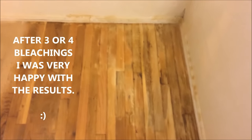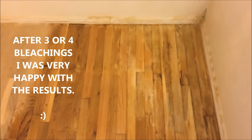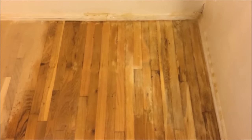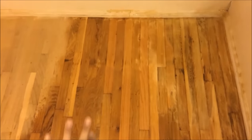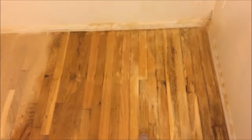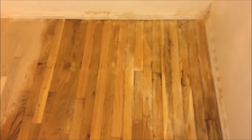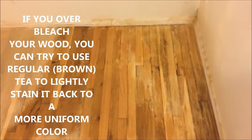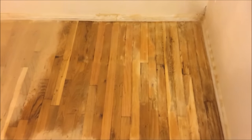It's a full day later and this is the result — it worked really, really well as you can see. I sprayed the rest of the floor so you can see the color that it's supposed to be. There are extra light areas where the bleach went past the stains, but I'm going to darken that with tea. Compared to before, the result speaks for itself.